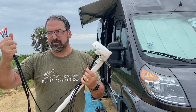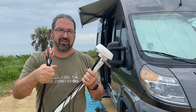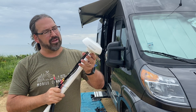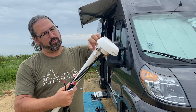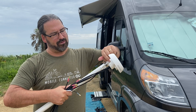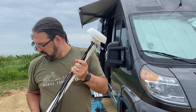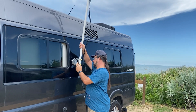The antenna itself comes with a six-foot cable. If you want longer you're going to have to suffer the degradation that comes from using an extension. You've got two different mounting options. As you see right here, we've got this pole mounted — it comes with a little pole mount kit that lets you attach this L-shaped bracket and mount it onto a pole. We're using this with a suction cup mount so that we can put it up the side of a vehicle easily.